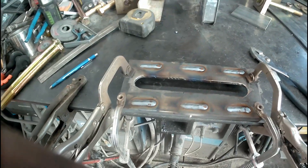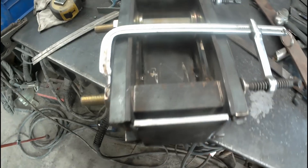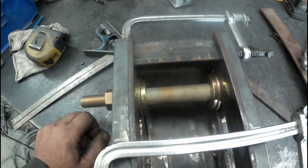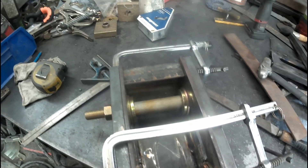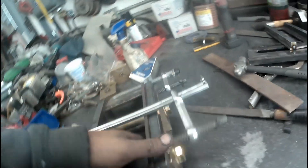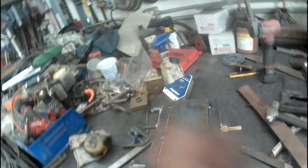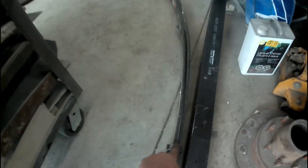We'll let that cool down and start piecing them together as a box. I've got it shimmed up with some fake spring eyes in there. I went 1/16th oversize to give it a little bit of play — 1/32nd on each side. I've got it spaced and clamped back in on these to keep it from spreading. My design changed a little bit from 4 inch ID to about 4 and 5/16ths ID, namely due to these tabs that stick out a little wider — I had to allow for it. I'm going to go weld this all up and take her apart.